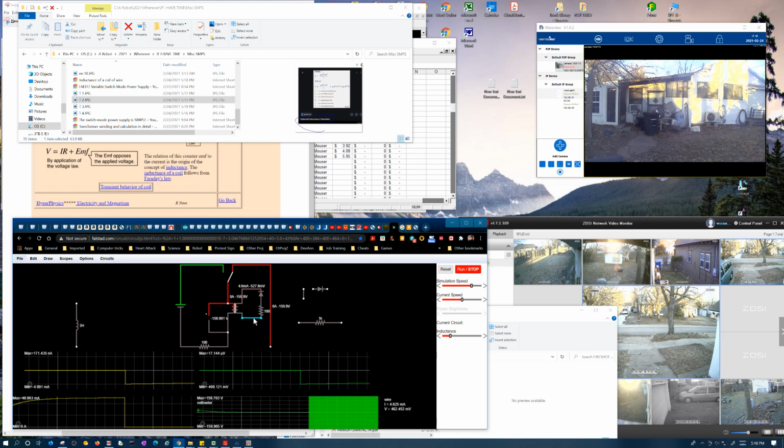And I don't know, though. With it being 0.5 amps, you'd expect it to drain that energy faster, but maybe not, because it's got fewer turns, so it might be drawing it out at a higher current but at a lower voltage. Again, it's a smaller inductance, and your voltage equals L dI/dt. So your dI/dt may actually be slower now because it's at a lower voltage. The current's higher, but the voltage is lower, so it spreads out in time, which is kind of what we're not seeing here, though.